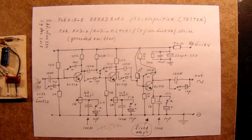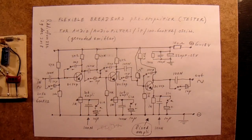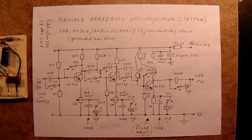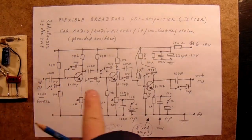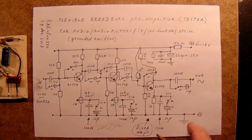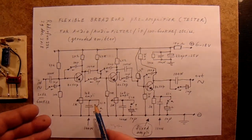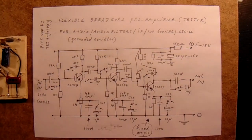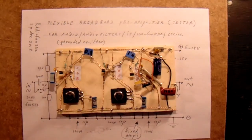You can learn a lot from it, and when you meet kind of problems and you make later on another circuit or another small amplifier, then you can know how such an amplifier acts. Connect your scope, for instance, here. Send in a sine wave. Touch it with your finger. You can see the noise is very much amplified in this transistor amplifier. You can see how such an amplifier acts in a frequency dependent way, a kind of bandwidth, etc. A lot to do, a lot to work,